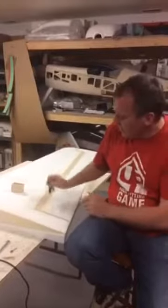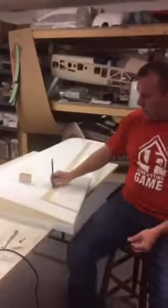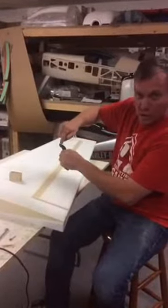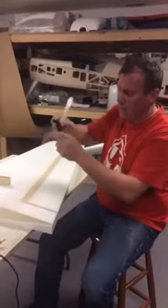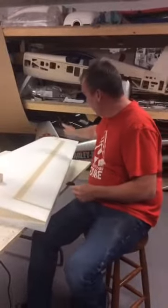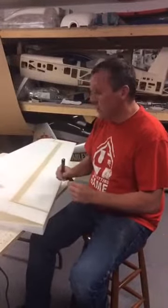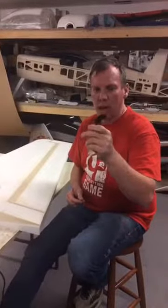The reason is because I want to set all these perfectly, and once everything is beveled, I will take my measuring stick, stick it down in there perfectly on the bevel, measure exactly up, mark on the horn exactly 1.5 or 1 3/4 or 2 inch, depending upon the wing. I pull it back out. I take these two that are for this pocket right here, and I match drill those. Then I come out here and I get this perfectly 1 3/4 and that one perfectly 1 3/4. That's the reason it is absolutely perfect geometry. Well, as close as you can get. There's never perfect. But that is the reason why I have these made by my buddy. Does a beautiful job. Just hold on right there.